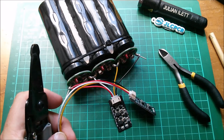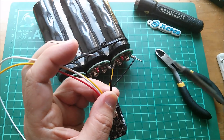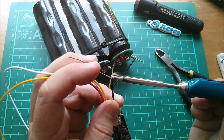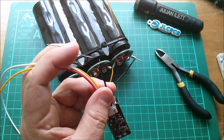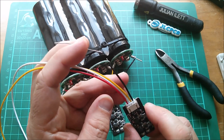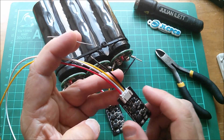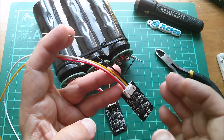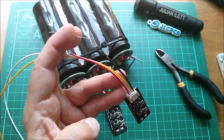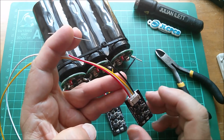Let's get the soldering iron. BMS boards come in such a variety that I'm not too concerned about having to parallel those up — you can get quite powerful BMS boards from the e-bike world, which is very big in China and increasingly growing elsewhere. The little MPPT boards — although they're not genuine MPPT and don't track — I might try paralleling those up, though I understand from my friend John Nodge that they're very inefficient, so I might be better off not bothering.